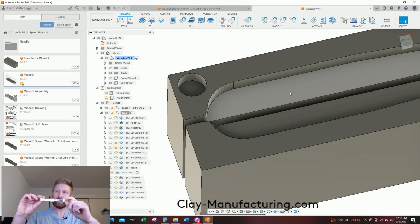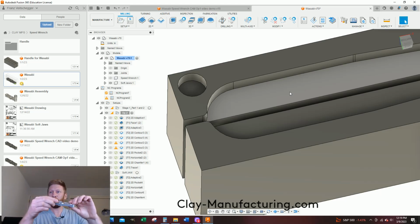In manufacturing, it's really common to have your Z0 as a bottom reference because it's really easy to get repeatable, pretty accurate within a thou by just cutting down. Because if you had your Z at the top and we just put in nominal numbers like 1 inch, the stock doesn't come at exactly that. It's usually oversized a little bit. It could be 7 thou oversized. It could be 20 thou oversized. So if your Z is on the top surface and you're not accounting for that difference in height, say you're running 10, 20, 30 parts, that means you'd have to update your thickness for every part you machine. So it's a lot easier just to have my Z reference at the bottom and machine down to it. That's what I'm intending to do.